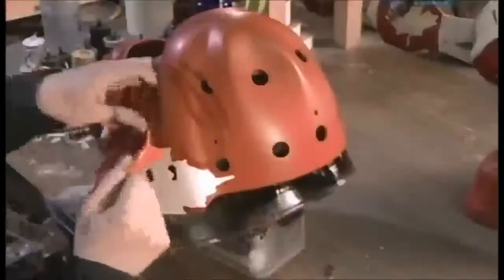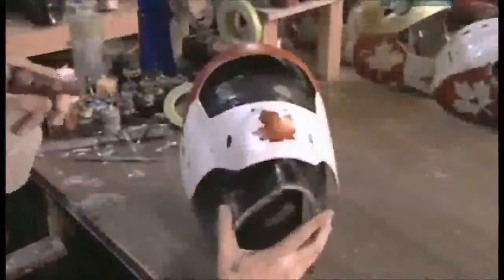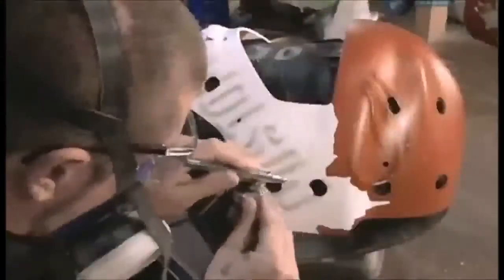Some of the vinyl is peeled away. The surface of the mask is sprinkled with water. Paint is misted over it, and the water droplets catch the paint. It's blasted with a heat gun. The water evaporates, but the paint dries in droplet form, giving the mask a frosted look. A drop shadow is airbrushed around some lettering. The technician dispenses with the usual safety gloves for this detailed work.